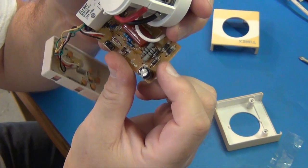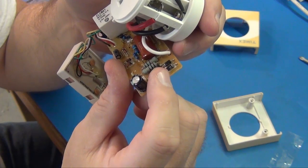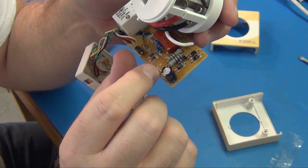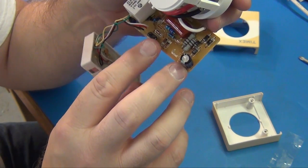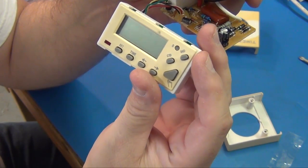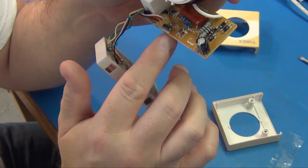Over here you have a bit of a bridge rectifier, and the bridge rectifier is outputting a pretty clean half volt ripple signal without a transformer of any kind, which I think is pretty interesting that they just do that flat out. And then it's got a voltage divider to knock down the voltage a little bit, and then it goes over to this area of the circuit, which I scoped out, and it was knocking it down to 2 volts. So you get 2 volts, nice and clean. Really, with the other passive components in there, it's getting about a 30 to 100 millivolt ripple 2 volt signal to this point. So this runs on about, well, actually about 1.7 volts because there's another zener in there that drops another 0.2. But that's the circuit.